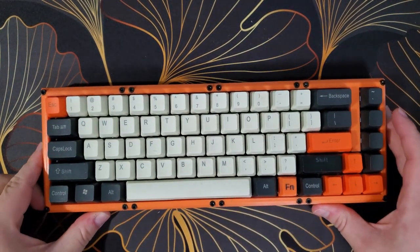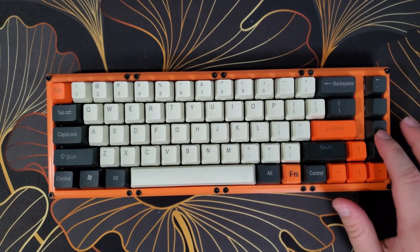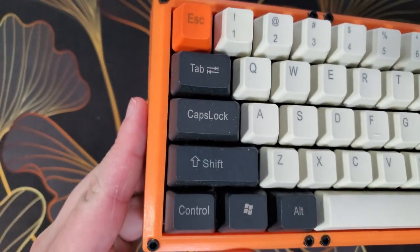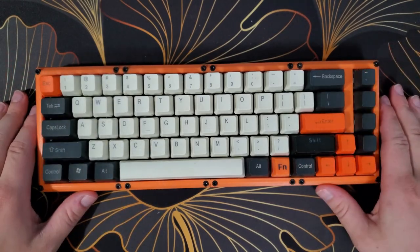Here is my first revision. I've modded the plate and the top bezel to add two more keys. After assembling this one, I realized how unusual it is to find keycap sets with two 2.25-unit shift keys. I also wanted to remove a blank area and use a different set of tactile switches.